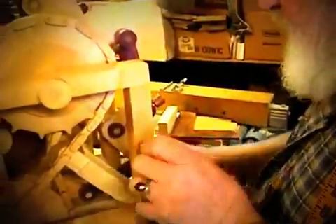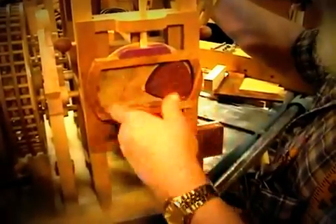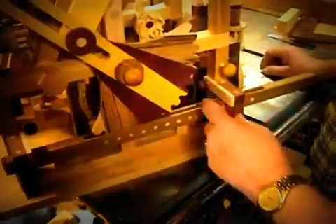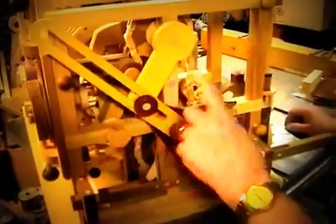And then here's some more bell cranks that work off of a crank down in there. And this converts rotary motion into reciprocating motion. And then here's another one that converts rotary motion into reciprocating motion. This device here going around raises this frame up and down at different speeds. And there's a rack and pinion type gear here, going back and forth on this crank — makes this go at a faster speed across the bottom than it does across the top. It takes longer to go in this arc than it does to go across the bottom.